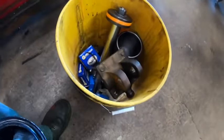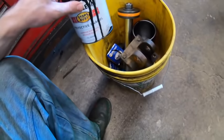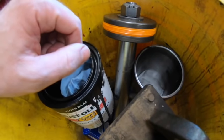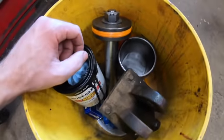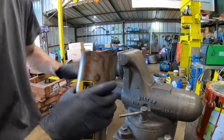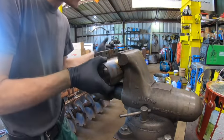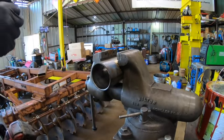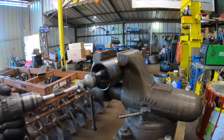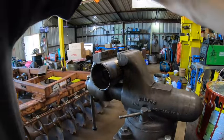All right, so we're back from the hydraulic shop — that was actually yesterday, I had some other stuff to take care of. As you can see I've got all sorts of treasures for this. I got all the seals needed to put this back together, and new bearings for the wheels. The hydraulic shop said that whatever this big orange band is called is vastly superior to the o-ring with the two flat things, and that's what they recommended. The guy at the hydraulic shop told me to hone the inside of this. There's like one spot of rust in here — other than that it looks fine — but they told me to do it and I want to take their advice.